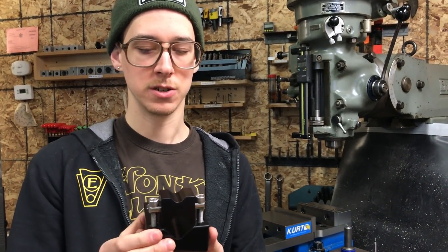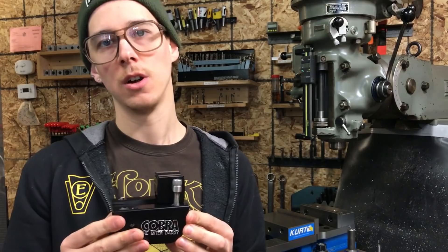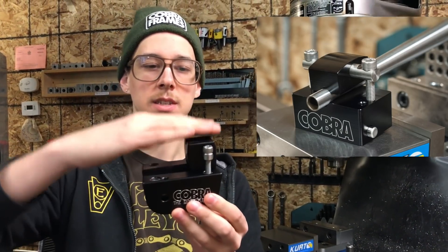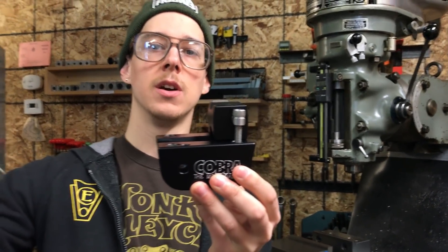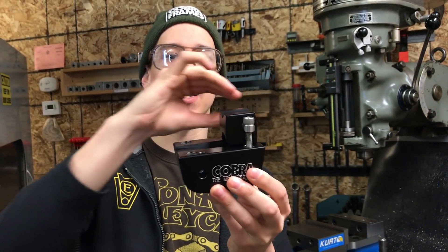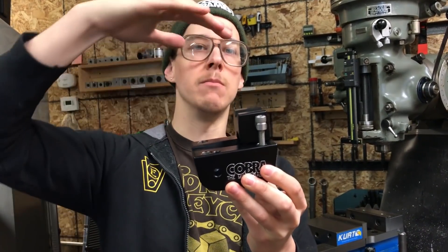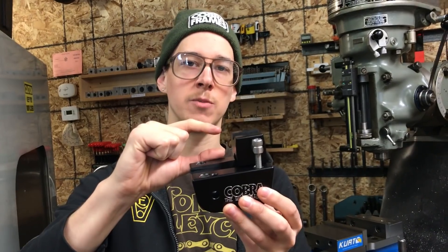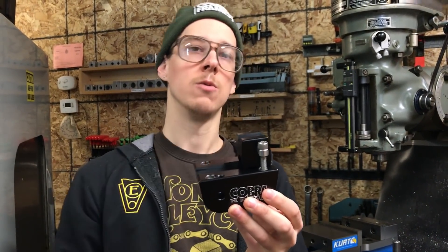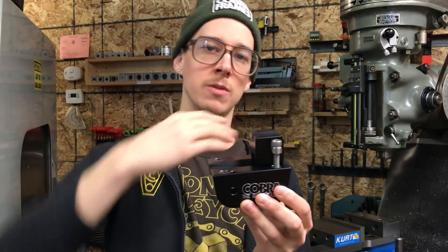You can also hold tubes with a taper, because this is a lot like my other tool called the Miter Buddy. The top clamping V-block sits on a round pin. So if you had a tapered tube — thicker here and kind of pointy there — that top one can pivot and meet the angle of the taper, applying an even clamping load. It doesn't have a pinch point on the large diameter end while not grabbing on the other end, which is the case with a lot of other V-blocks. It just pivots and gets a real nice clamping load without any pinch points.